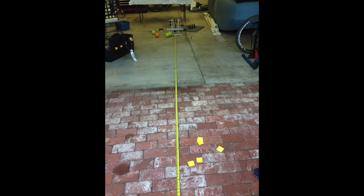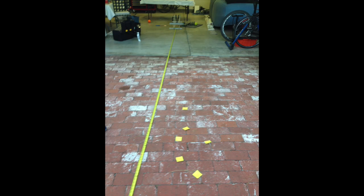We tested two configurations of our flywheel shooter: one with a lot of backspin that didn't quite reach the distance needed to hit the goal, and one without backspin. This scatter plot shows the balls with a lot of backspin — they're pretty clumped together because the backspin helps keep them on a consistent path. The scatter plot for the shooter with no backspin shows it went much further, since the energy isn't being used to generate backspin, but it's noticeably less accurate.